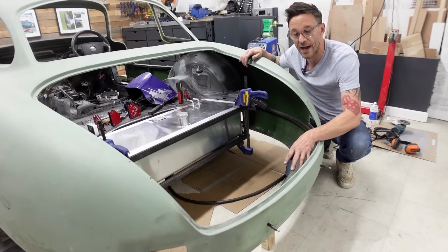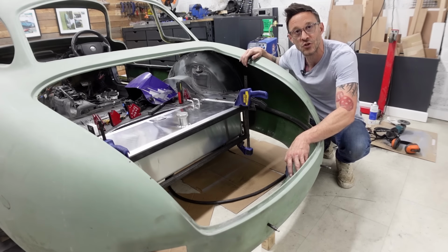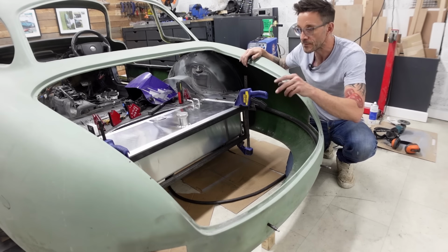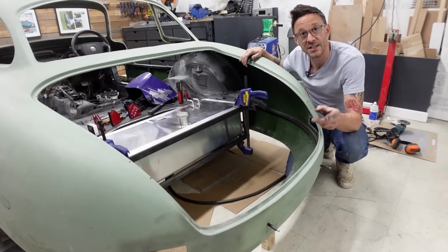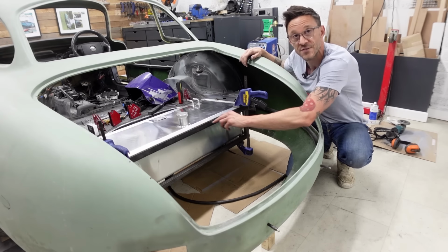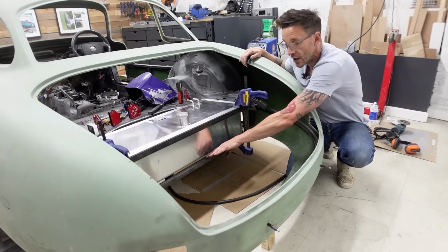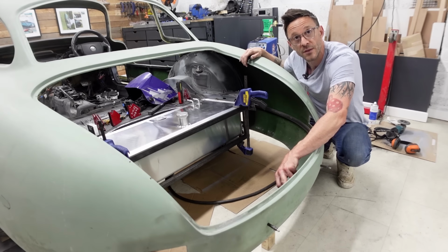What I want to take out is any possibility for any up and down flex that this tube has, because at the moment it's unsupported along a lot of its length. Because triangles are incredibly strong, what I'm planning to do, and the reason I've created this frame at the back of the tank, is I can get an angled piece of either box or tube work that angles up, that picks up on the hoop that runs around the perimeter.